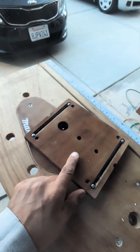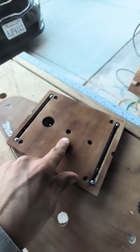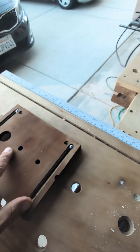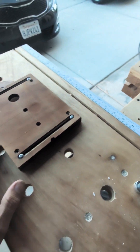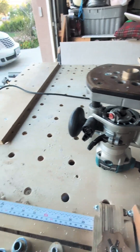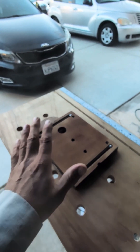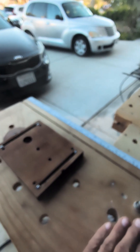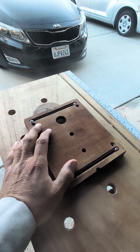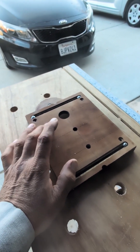I'm going to call this the Smart Guide 1.0. I cut this out on my laser — from center to center it's 96 millimeters, the one in the center is split at 48 millimeters, and this hole is 3/8 of an inch. The reason for the one-inch hole is that the guide bushing is one inch, so I'll be using my router as a kind of drill press — a plunge router — on a 96-millimeter rail guide I'll show in a bit.